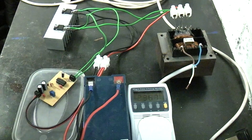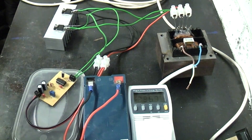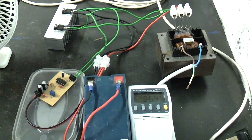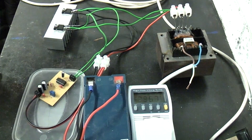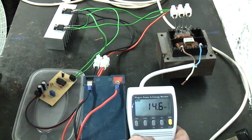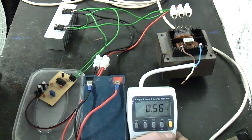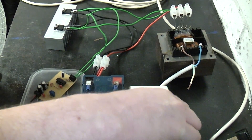The fan is running — it's going around and working quite well on the 50 Hz square wave. I was quite surprised it seems to run at full speed. In terms of power, it's drawing 14.5 watts, but in VA it's drawing 25.2 volt-amps, so there is a difference in power factor. Checking the power factor at 50 Hz, it reads 0.58.